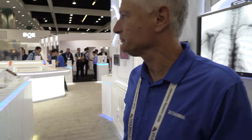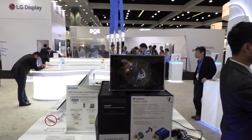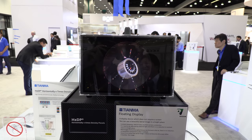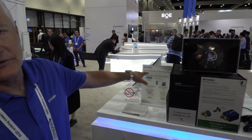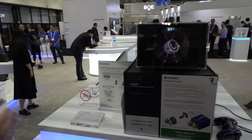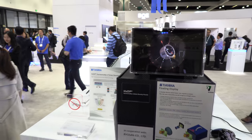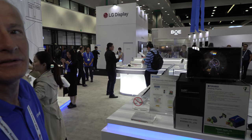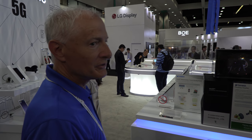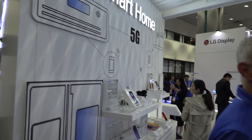And here is a special floating display — something is going on right here. It's based on what we call our horizontal double density pixel structure, which takes a vertical RGB, rotates it on the side, splits it at the sub-pixel level, and adds a lenticular lens on top to direct the left eye and right eye views. Is it like a holographic display? It's an autostereoscopic display.